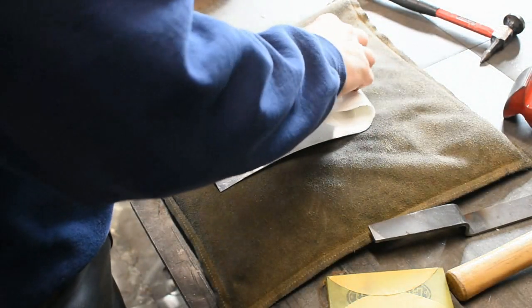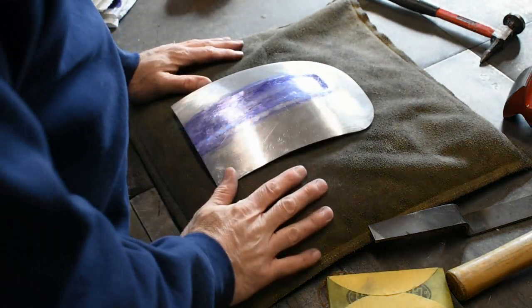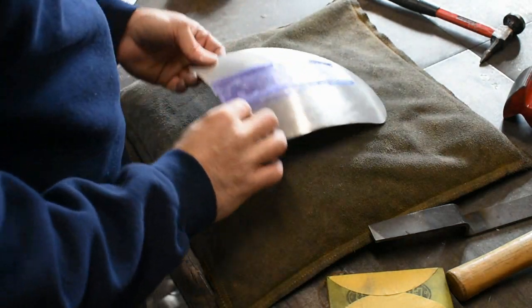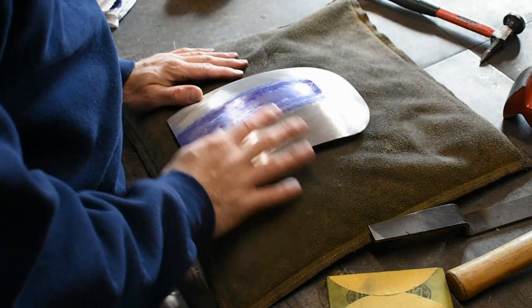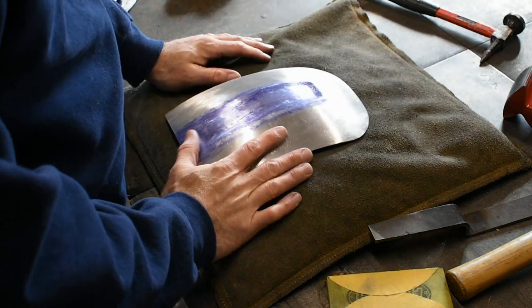Generally, I prefer to use a hammer, slapper, and dolly to even everything out, but sometimes in tight spaces like this, especially if you have plenty of material that you're not worried about filing it thin, a pick and file technique works out really well too.